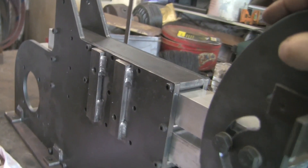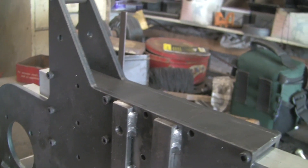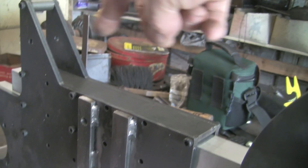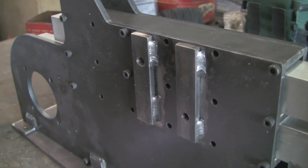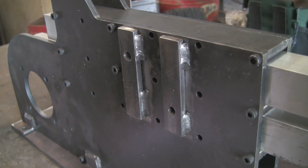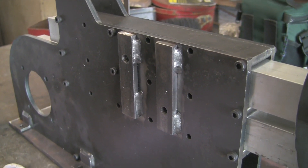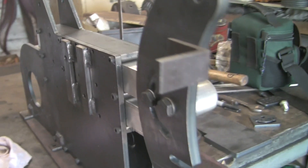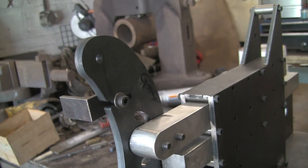I've just mocked up a belt on it, and I probably would get away with it - they're low enough that by the time the idler is up here somewhere, or the tracking wheel, and it comes from down there up here, even if I've got a small wheel on, I probably would get away with it. But just to make sure and future-proof it, I'm going to have them off and stick them on the other side. That's the beauty of metalwork - you can just fill holes up with welders, cut stuff off with grinders, and start again.